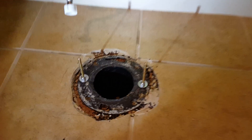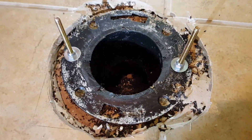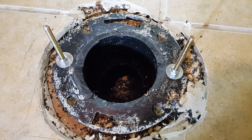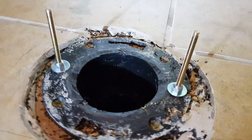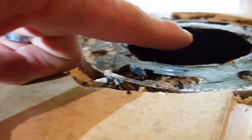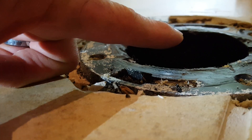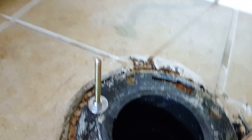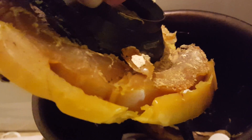However, this assembly here — the center portion is the pipe that comes up through the wall, the sewer pipe, four inch. Looks like a three-by-four closet bend, and then the flange was glued to it. The exception is this closet bend was stubbed up probably about a half inch to three quarters of an inch beyond the flange itself. So the horn on this wax ring was sitting down on the pipe — it wasn't hitting the flange, it was sitting on that ridge of the pipe. You can see it's kind of recessed right there, so the wax was kind of encapsulating it, and I think that's where we had our leak.